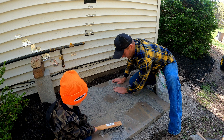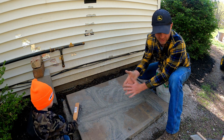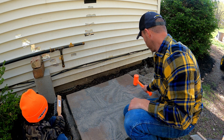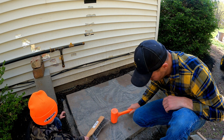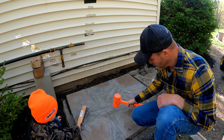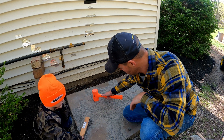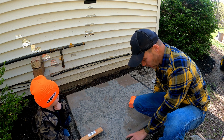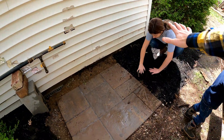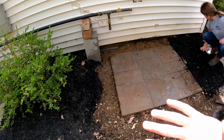Levi's doing a good job getting it up to the edges. I'm going to take a dead blow hammer and use it to consolidate the joints — this substitutes for what a vibratory plate compactor does. You can see how it works the sand down into the joint like that. Just a light dead blow, nothing aggressive. Note that when you do run a compactor, you don't want to do it directly over top of your sand. We want to get the sand to within about an eighth of an inch of the top of the paver, or right to the bottom of that chamfer — the angled edge at the top of the paver.